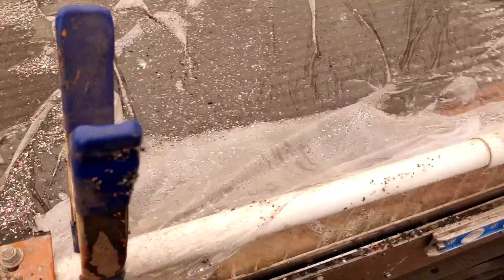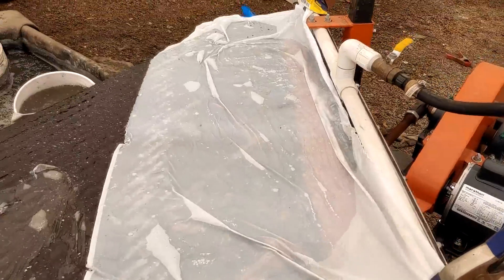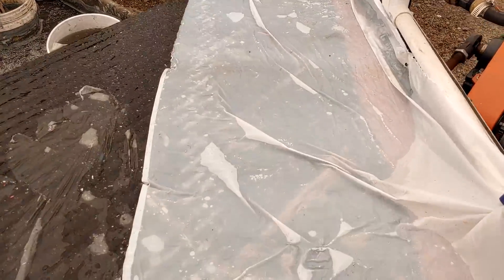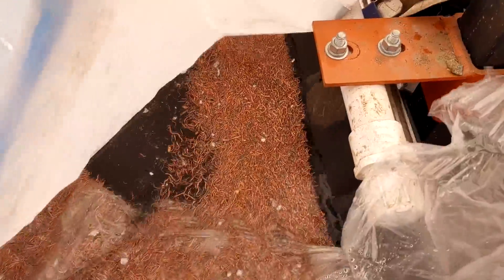I just finished up the last of it. Here's another shot of our clean insulation going down into the number four — a big wide band of copper. The aluminum is separating out, running down pretty much into the number two. I expect the number two has a little bit of copper and aluminum in it, so you could probably just rerun that through the granulator again. And here's this band of copper coming down here.